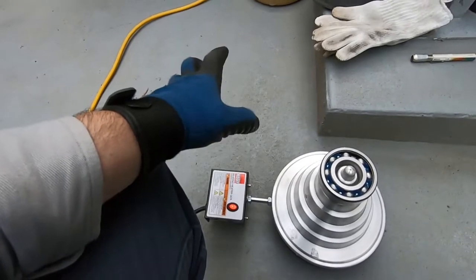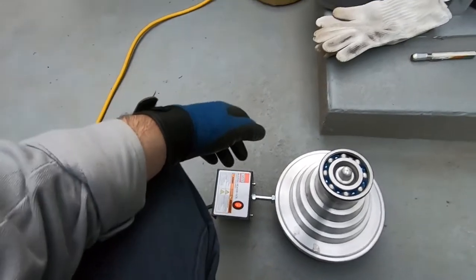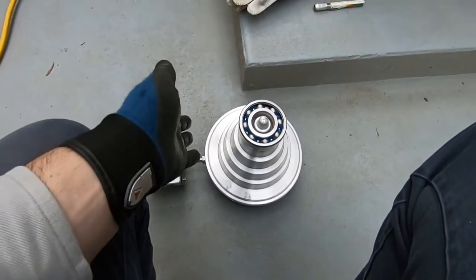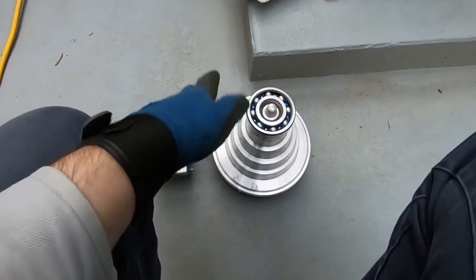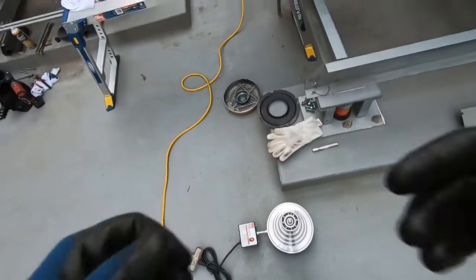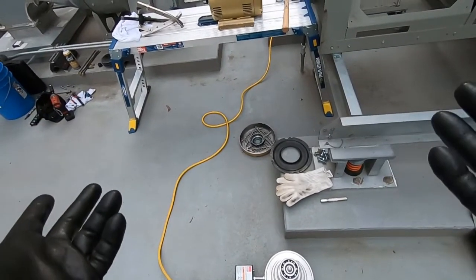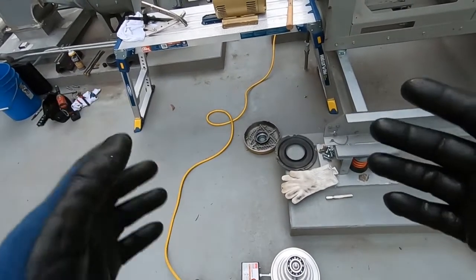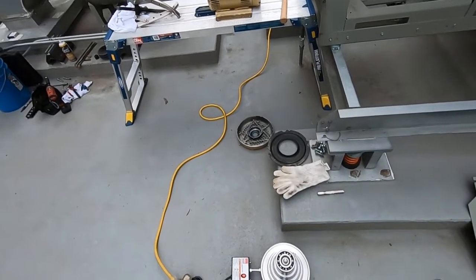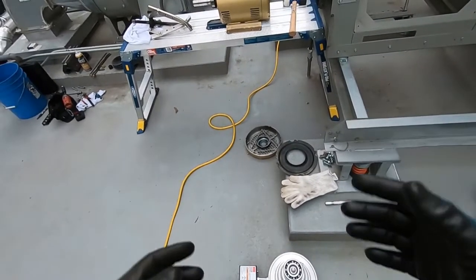I've used this cone heater before in some other videos I have. I really like it, and it hasn't let me down yet. Worst comes to worst, if you can't get this cone heater for bearings, or say this one craps on me, you can get a cheap little, basically toaster oven. As long as you can get it up to, I'd say 400 degrees, you're good. On a small little one that you can probably go pick up from Walmart or something, really cheap, maybe a 99 cent store. I don't know about 99 cent store, I don't feel that, but. Just a small little cheap